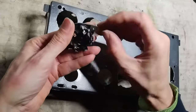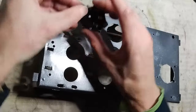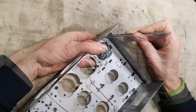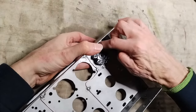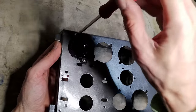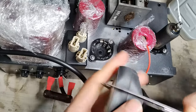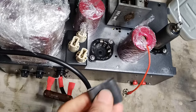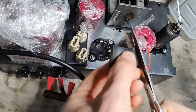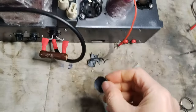While putting the tube sockets in place, also some rubber suspensions were added after the concern that the sockets could break again. This rubber is probably useless, but it does not harm either. Inside some of the original sockets, there was a piece of cardboard used to lift a little bit the base of the tubes from the bottom, probably to allow an easier extraction. Based on the fragile condition of the tubes, it seemed appropriate to do the same also with the new sockets, but this time using the rubber from an old bicycle inner tube.